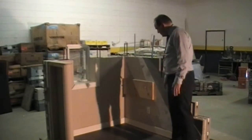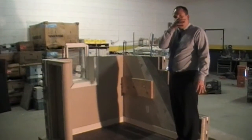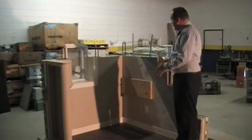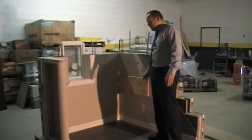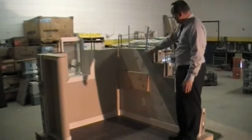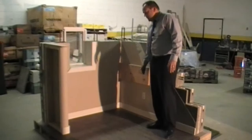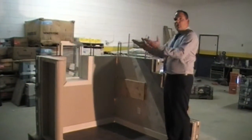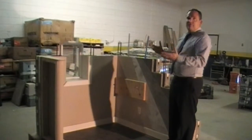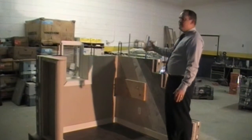When you come into the basement, you come right off the footings and continue up past where the floor would go. We then put a ledger plate on there — you bolt it into that first layer of blocking concrete as it goes across. You put hangers down and lay the joists right in those hangers. Once the joists are in, you sheet the floor, everything's done, and you continue to work off that surface. It's a lot safer for the trades as you move up and build the rest of the house.